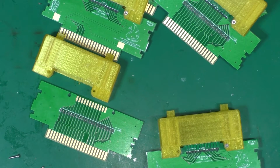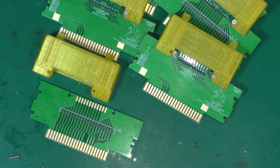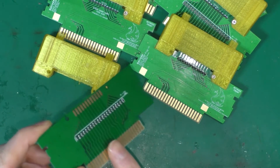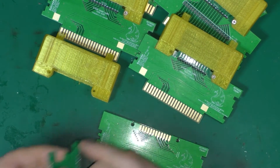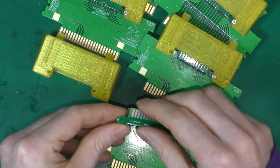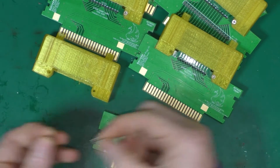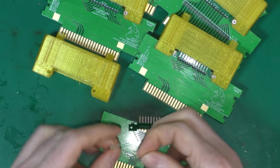But anyway, I already talked too much. I'm going to put that on the store, and if you want to make this one, I'm going to put all the description on GitHub. For this PCB, the contacts must be at least ENIG. If you want the cheaper solution, 1.2 millimeter thick. Those two you can find somewhere, like OSH Park is going to make them. 1.6 millimeter for both. I'm going to put the description for the connector at DigiKey. M2 screws, 10 millimeters. I think 12 is slightly too high, but at least 10.